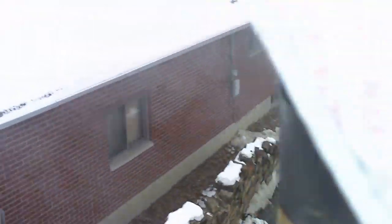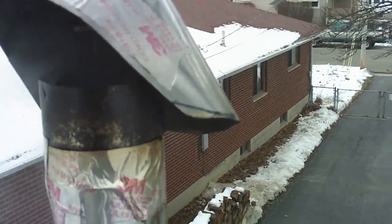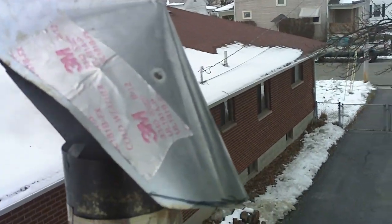As you can see here on the top, mostly what I get out of the top of this thing is steam. A lot of people wanted to see my wind cap. As you can see, it's kind of packed in grease. I took an old router bit that had a ball bearing guide in it and just welded it on a cross piece on there to make it pivot. I've been burning this for a couple weeks like this and it'll pivot pretty nicely with the wind. It's cheap — I made it out of some four-inch round pipe, pinched the end on top, burned a couple holes here and there, and trimmed the bottom where it came out into a square and rounded it off. Works pretty good, like a weather vane.